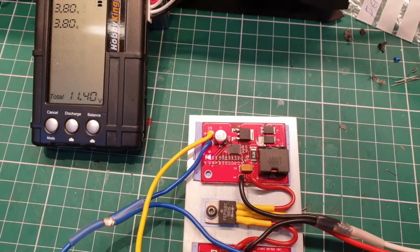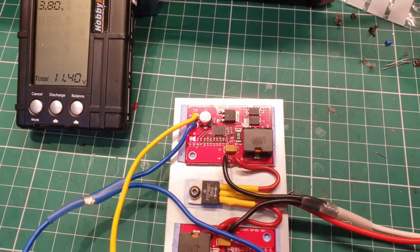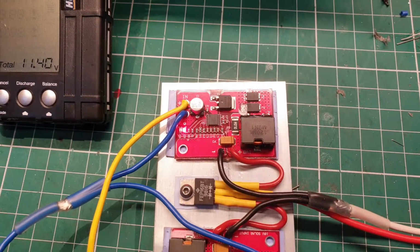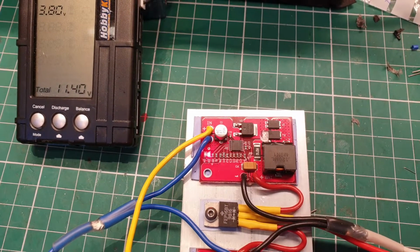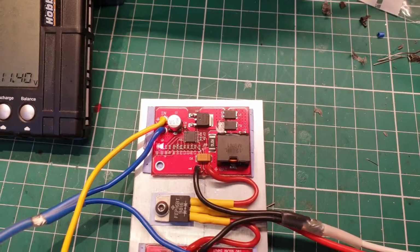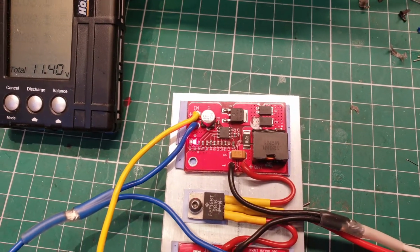They're supposed to be MPPT, but they're kind of pseudo MPPT. They kind of hold the panel voltage at about 18 volts to achieve as close to the maximum power point as is possible. They actually are surprisingly efficient. They don't seem to lose any actual wattage. Use about a watt in their conversion, having tested both of these.